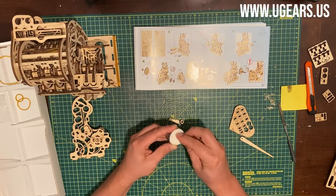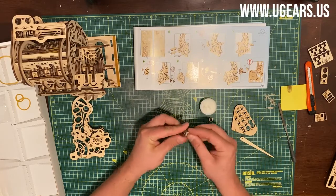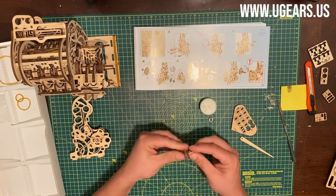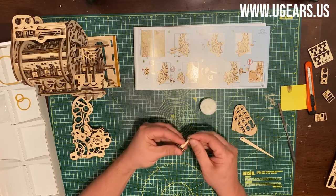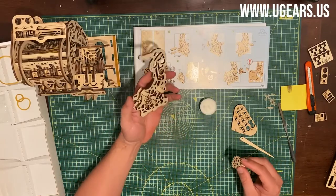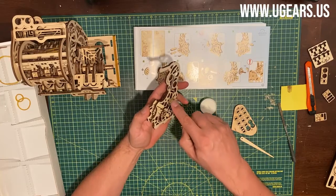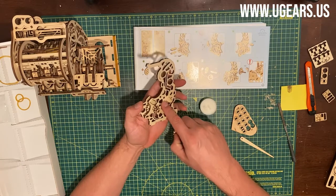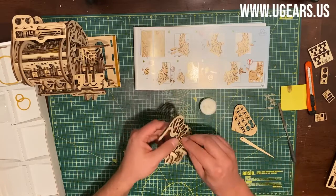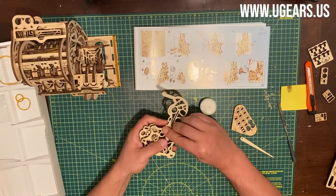And 89. So 131 goes on the shorter end, locking it with 127. And then 89 goes on the other end as far as it can go. That sub-assembly, where the small gear is at, goes into the hole, not the first hole right next to it, but one above it. Right there, and then 132, and I would wax a little bit of that surface right around where the gear is going to be spinning.